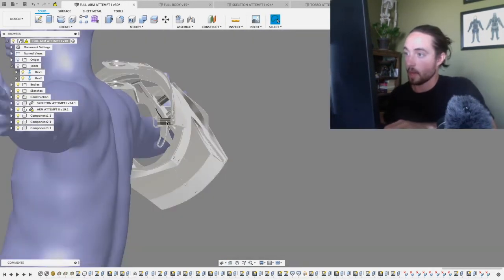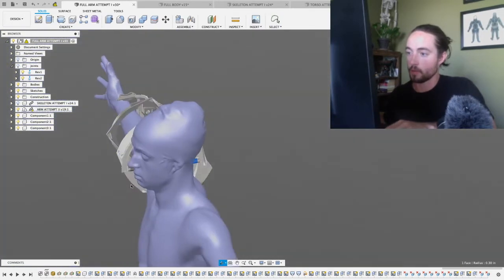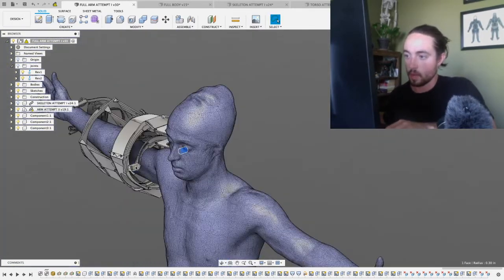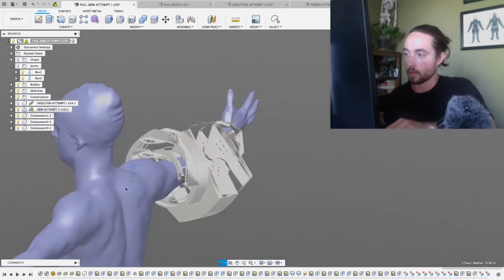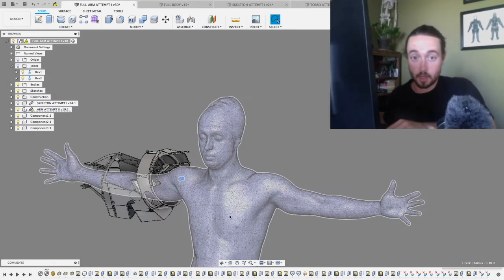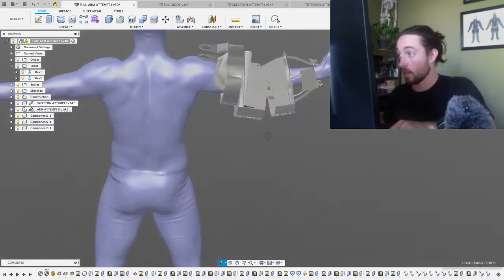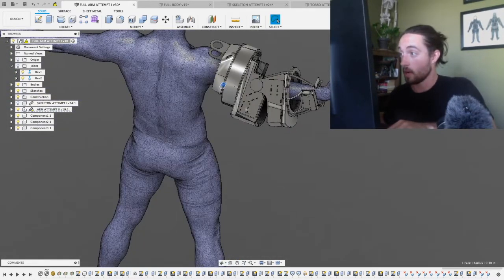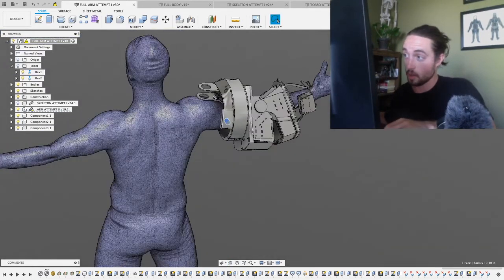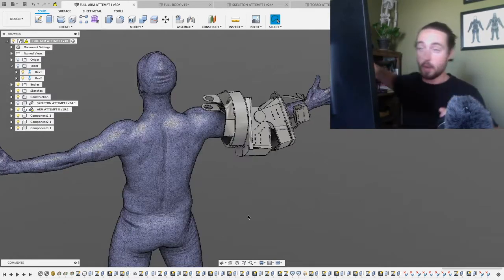They come back, and they come over these things. These are pivots for the exomuscles, and those come up and over there. That's the one for the pec, and that's the one for the lat. The one from the pec comes from over here in the chest, and the one from the lat is coming down from the pelvis, and it goes over the lumbar, and then over this, and then down. Those two insert into here and here. The reason for doing that is the predominant motion these will be generating is on these two pivots, and that'll be to pull your arm forward and backwards.